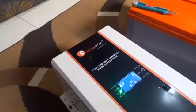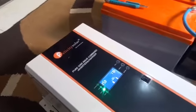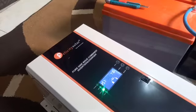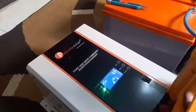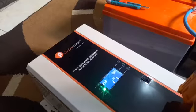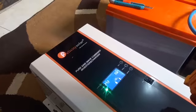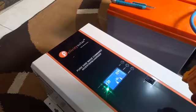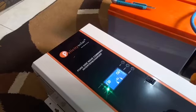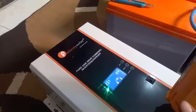The load on the inverter was zero, then I put the heat gun on the low setting. The inverter is making some humming sound, but the heat gun is working — it is doing 770 watts. I put it on the highest level and it is now 1.5 kilowatts. I don't understand why the humming stopped but it can power this heat gun at 1.5 kilowatt.